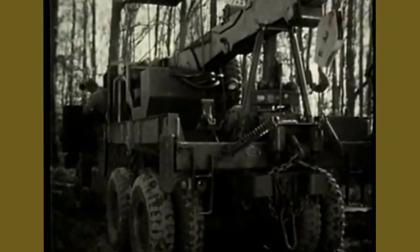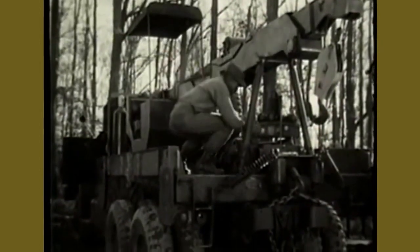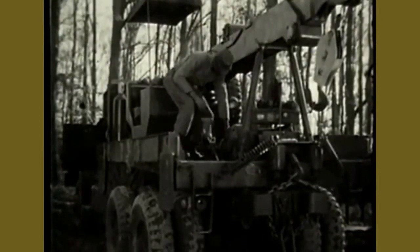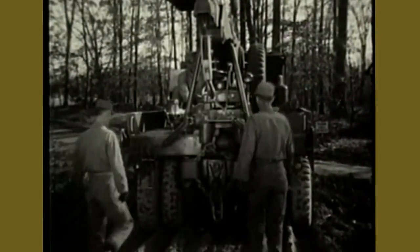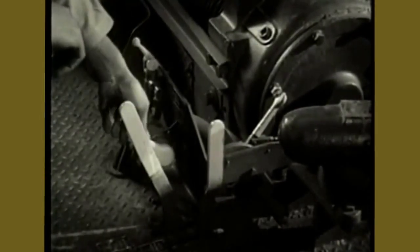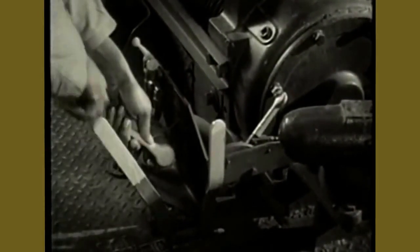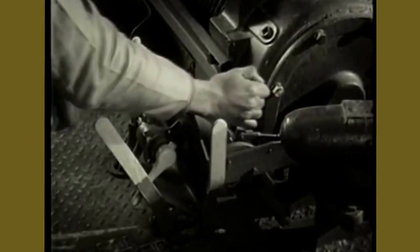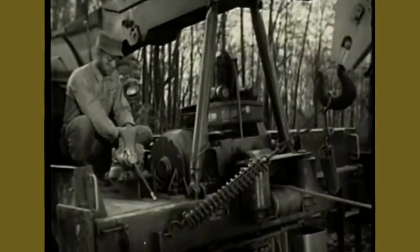The next step takes place at the rear winch assembly. The leveling device lockout is pulled out and the operator moves to the winch control area. While the men prepare to unhook the cable, the operator makes sure the cable tensioner control valve is off. Open the clutch air control valve, cutting off the power flow. Shift the winch control lever to payout position. Close the clutch air control valve. Slowly open the throttle as needed, not to exceed 1,000 RPM. Because the rear winch cannot be free spooled, the cable must be paid out with power.